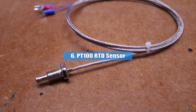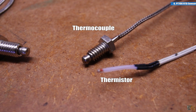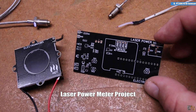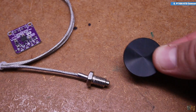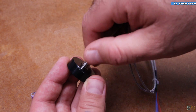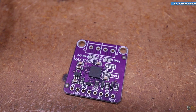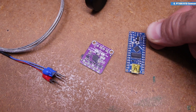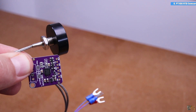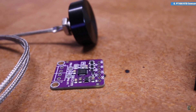The next product is a sensor and a module. This is an RTD, or resistive thermal device. Till now for temperature measurements I was using a thermistor or maybe a thermocouple. But for my new laser meter project I need a lot more accuracy, and I was told the PT100 is the best choice. I also bought this black anodized metal knob which will work perfectly for the laser meter project — the RTD sensor fits perfectly inside the thread. To read this sensor we need this amplifier, the MAX31865, which works with SPI and is compatible with the Arduino library. It can measure temperatures between -200 and +850 degrees. I will use this combo of three elements for measuring laser optical power, hoping for better results than the Peltier cell I used before.